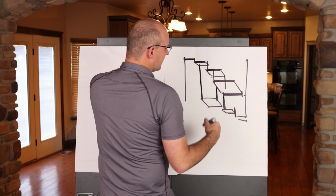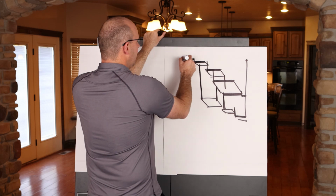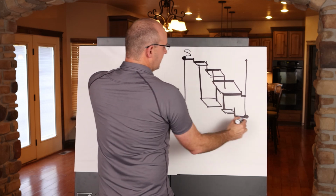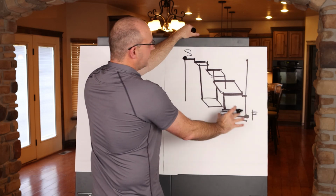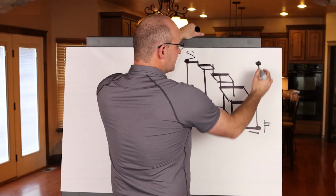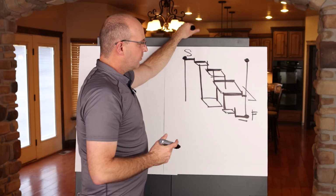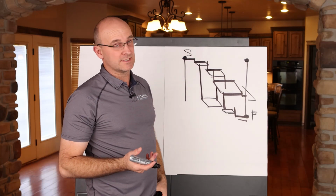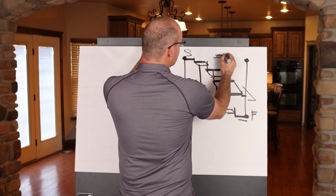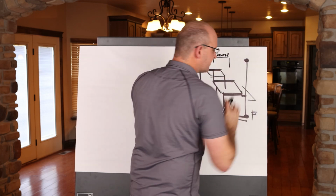You can sketch this out. Like I said, you can have this in Intact or you can have this in Excel. And what you'll end up doing is being able to see, hey, between my start date and my finish date, I think I have a pretty good structure and I have a plan to finish. Now that's key, because if you had an overrun, like let's say one of these phases went past, or you had any other problem where the sequencing wouldn't work, or let's say you had winter weather days here, right? And these phases wouldn't fit and there's a risk for it to push out.